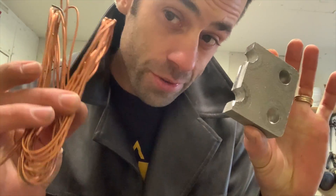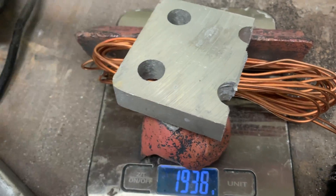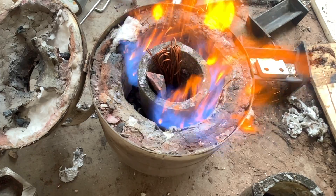For metal I'm going to be using aluminum bronze — a mixture of about 90% copper and 10% aluminum. Aluminum bronze is one of the hardest of the bronzes, so it's a good bronze for blades. Though 10% aluminum bronze turned out to be a mistake, and I'll show you why a little later.